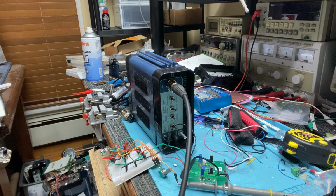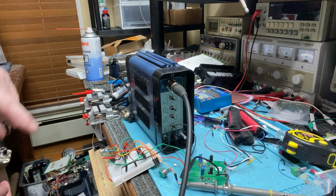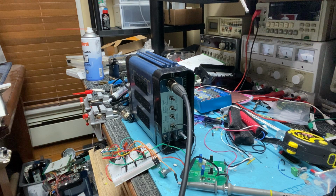a lot better if you buffer it. You're going to get a lot more out of it. You get more range. I've tested this so far with a coil. I can get 1.5 meters out of it just on an 11-inch coil, and that was with this sitting at 100 millivolts per division. I can get this down to 2 millivolts per division, so it'll go out a lot further than that. I can probably get 3 meters or 10 feet out of it, and it'll still pick up